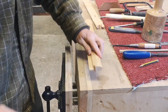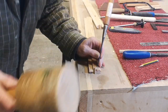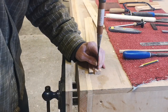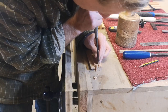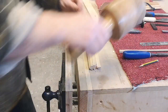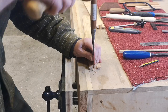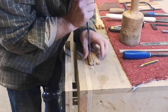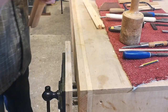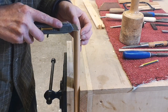Right, let's get sawing — always try and keep your work piece vertical. Once that's sawn, we can pick up a skinny chisel and chisel out that little piece. Remember to work back to your knife line. Flip it over and work back in on the other side.